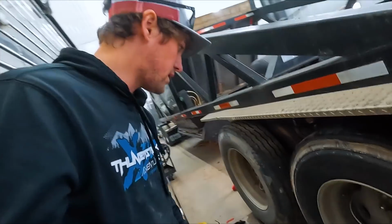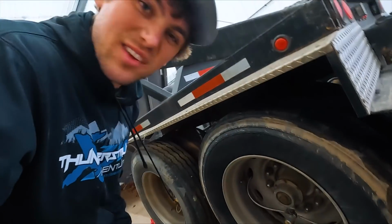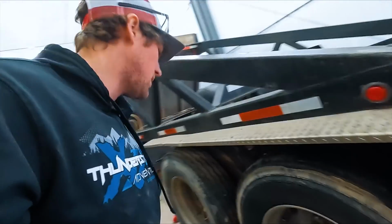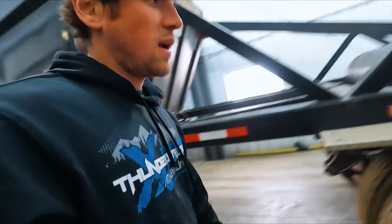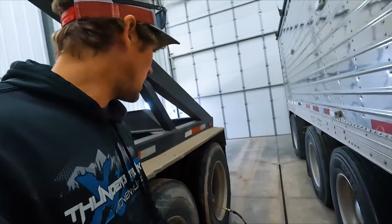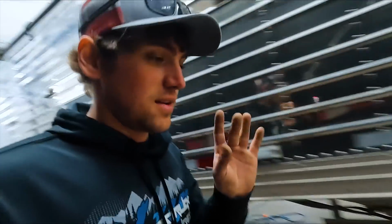Well, there we go. Nothing to it. Cleaned the hole out, cleaned the face of it, tightened it really tight. Should fix the problem. We'll let her air up here and I'll check it for a leak again. But that wasn't too bad. Didn't have to even take it off. Just broke the bead, get the pry bar in there. A little sketchy doing it yourself, but all my fingers are attached yet.